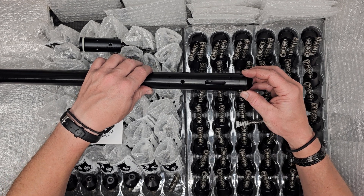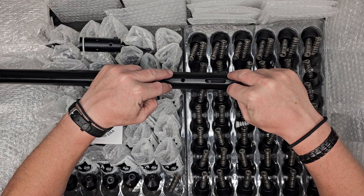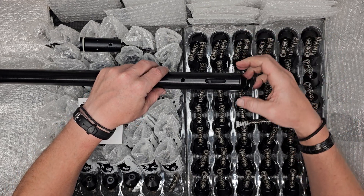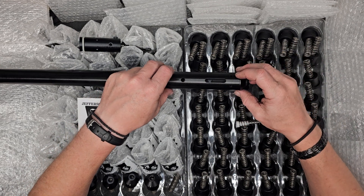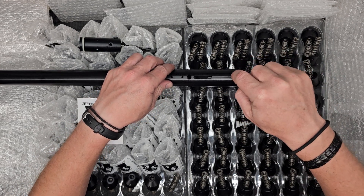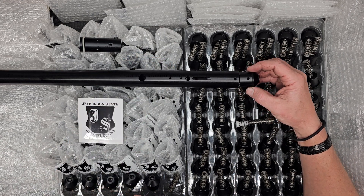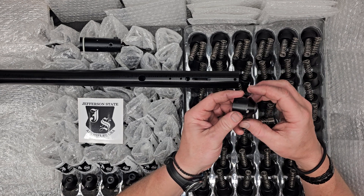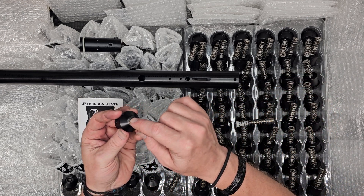This would be the top. There'd be four screws holding down the breech. We can leave the front two and pull the back ones, then flip it over and pull the back screw through the trigger housing in order to slide the factory plug out, which is going to have a much smaller hole.